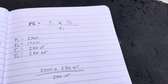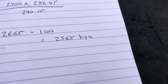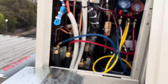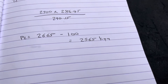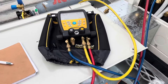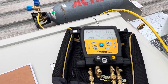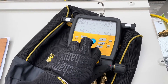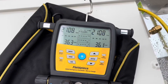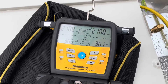We knew it anyway, but just to confirm — that's what our pressure should be. Give or take 100 kPa based off losing it through your hoses or whatever. I mean, they didn't take their hoses off, but really we should be a lot higher than 1600 kPa. So I've gotten rid of the analogs and put my digitals on here, because I'm going to put some more nitro in and run a pressure test. I'll just let my gauges equalize out for five minutes or so. We'll sit at 2100 and then we'll start the pressure test.